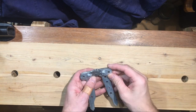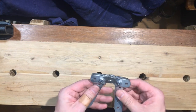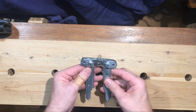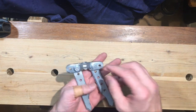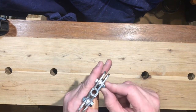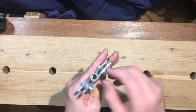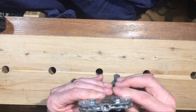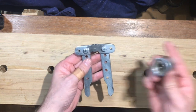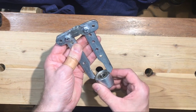We've done a little bit of work with the welder and the grinder. Those two nuts are still in there - it's fairly rough welding. I couldn't jig it up quite as well as I thought, so there's a little left to be desired in terms of squareness, but it's going to work fine. The holes are through and I've cut off some bolts. I'll put nylock locking nuts here so it works as finger-tight. I need to clean the thread a bit and give it a quick spray of primer - that's almost a tool.